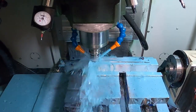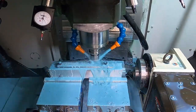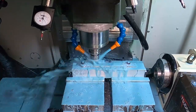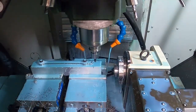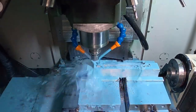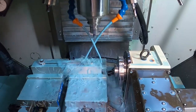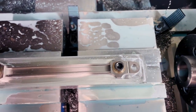This is one of those very rare situations where increasing the RPM reduces chatter. The slower RPM was pulling up hard on the middle of the rod where it's not as well supported, so increasing the RPM reduced that upward force on the part, reducing vibration. The finishing pass runs at about 10 inches a minute at 3200 RPM, which with a 5 flute cutter leaves a very nice finish. I still need to drill and tap the 10-32 holes for the fake grease fittings which I forgot to film, but these are nearly done.